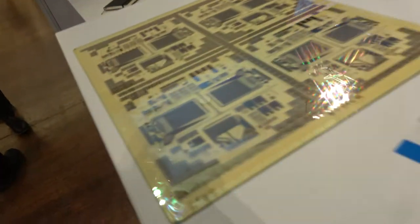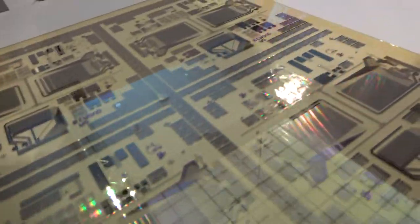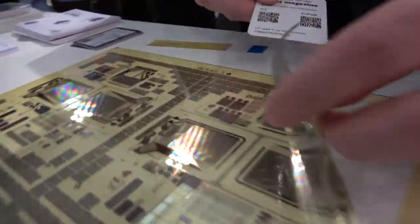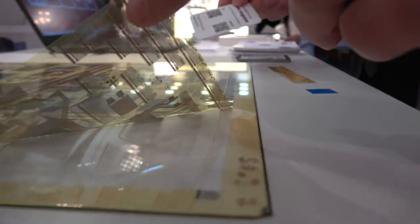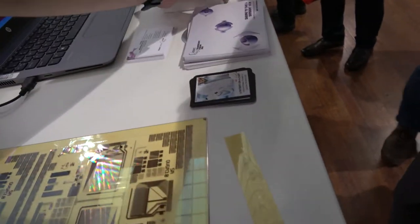Here's the way how we make this technology. This is a plate — sheet by sheet, sheet-to-sheet processing. This very thin plastic film is laminated onto a temporary glass carrier substrate. These are the different test structures and different chips that you see in this area. It's processed on a plate, and the foil is removed from the plate, and then it's cut into smaller pieces.